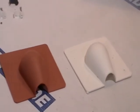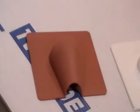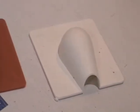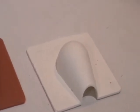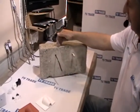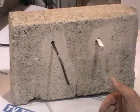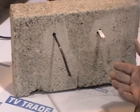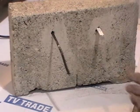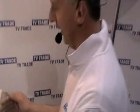A very common job when installing a satellite dish is that the installer will drill a hole directly through your external wall. They'll normally drill from the inside out for two reasons: first, for safety — they don't want to hit the power mains, a gas line, drill through timber, or split your skirting board.